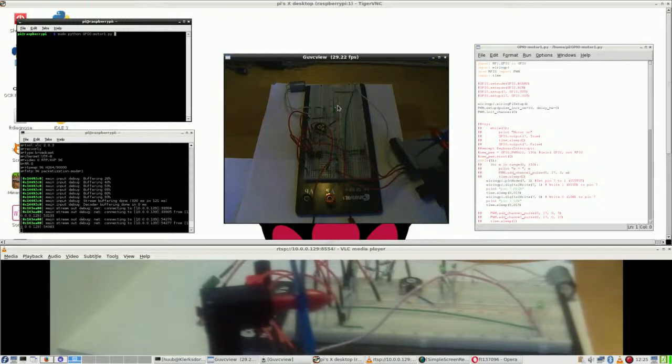Now the point is, of course, that while this works, this motor has some properties. Well, I have had some response on the fischertechnik forum regarding this motor, and actually not too surprising in values, because what I earlier thought, as used with the Arduino, the frequency was between 60 and 120. Well, the advice is to use between 100 and 200 hertz and not kilohertz.